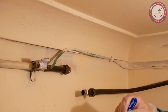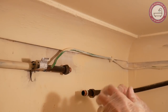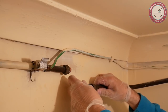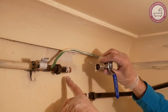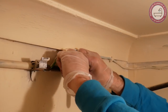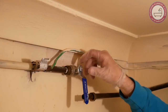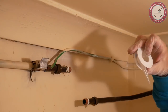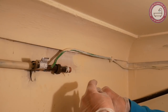I'm going to replace it with a lever valve. These lever valves are so much better — stopcocks just get seized shut, they're next to useless. I'm going to pop that on, but first I need to check the depth of the olives is correct, which it is, so that's all going to work absolutely fine. I've got some compound but I'm also going to put some PTFE tape on there as well — belt and braces. These are industry-standard nuts, still imperial, but that's going to work absolutely fine.